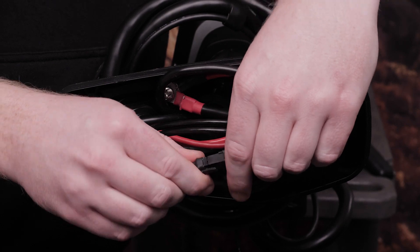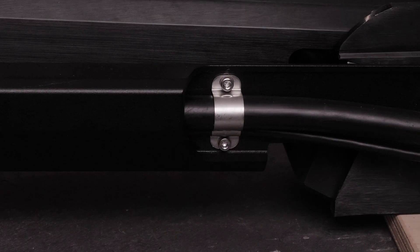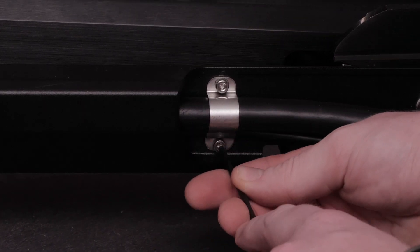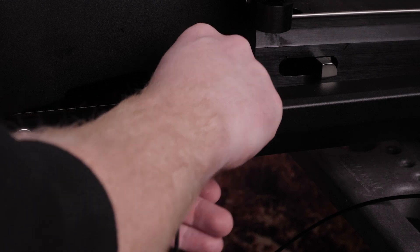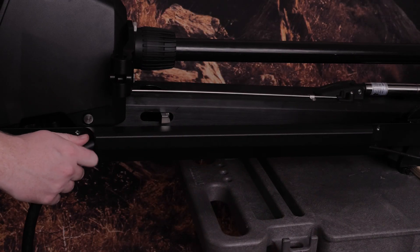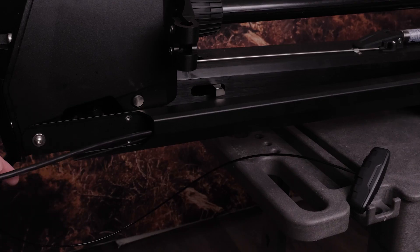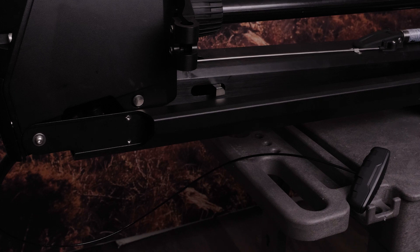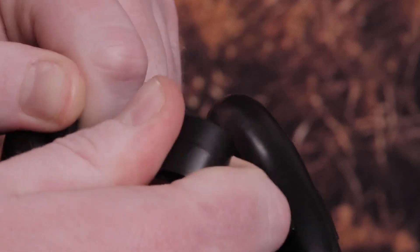Press the tab and pull on both sides of the connector to disconnect the data cable. Remove the cable clips holding the transducer and power cable using a three millimeter hex bit driver. Remove the cables from the channel. Remove the plastic cable clamps that secure the transducer cable to the coiled power cable. Keep these cable clips to reinstall later.